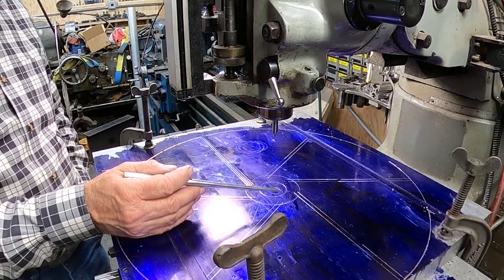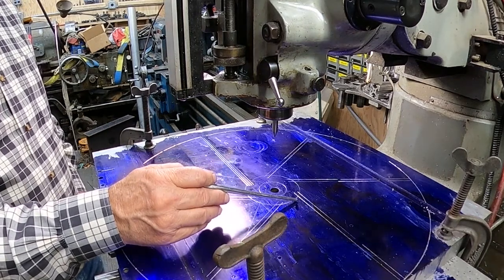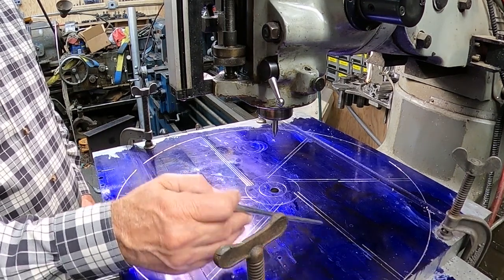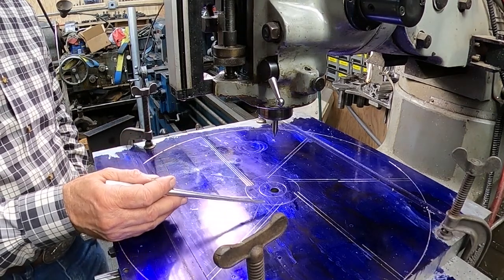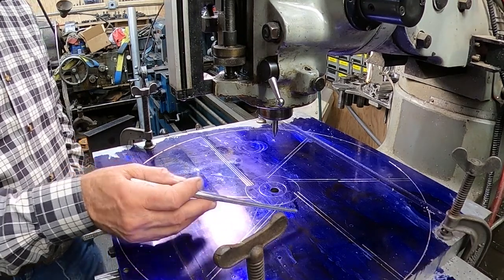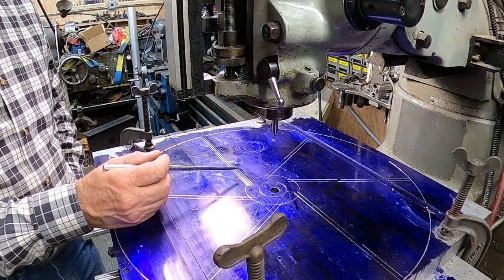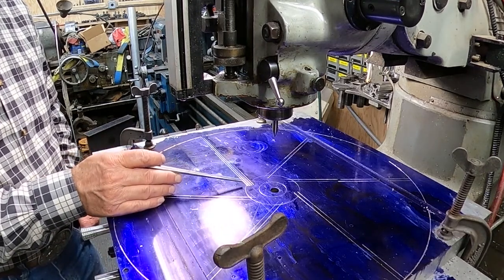So we'll be taking off 5/8 of an inch out of here. And I'm going to attempt to use a bull nose mill and finish this off with a bull nose mill all the way around here, so we have smooth radiused surfaces instead of sharp features on this wheel. And when I'm all done, I'll bull nose the whole diameter of this as well, again, to soften all the features of this fan.